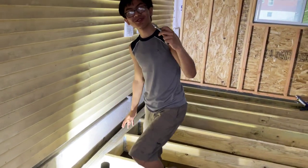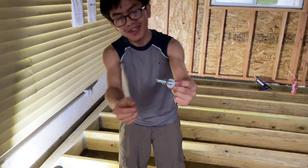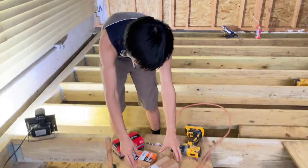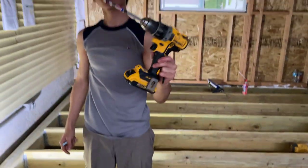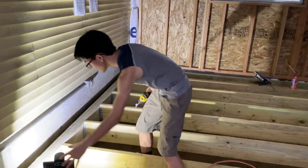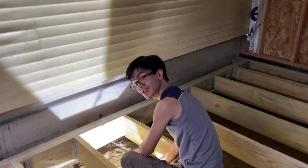Let's demonstrate how to actually install a carriage bolt. As you can see, carriage bolts don't have a tip for drilling, which means we need to pre-drill a hole. In our case, this is a three-eighth-inch diameter bolt, which means we need a three-eighth-inch drill bit. We're going to use this hole right here — let's drill.